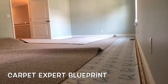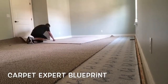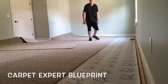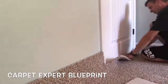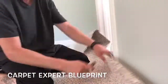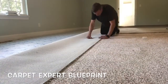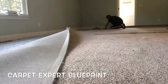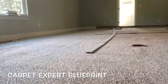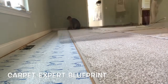We have a 23-foot by 12-foot piece of carpet here, and clearly there's going to be a seam in the room. We get everything lined up so there's roughly two to four inches up each wall so I have something to kick and stretch onto the tack strip. Once the piece is set up and rough cut in all the areas, I'll bring the fill piece upstairs and shape that out. I'm going to throw a fresh cut on the backing — if you're a newbie use a straight edge, but if you've been in the game a while you can use a row cutter, a top cutter, or just cut from the back like I like to do.